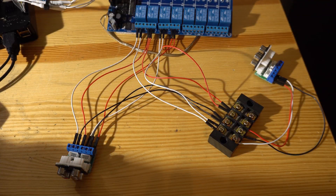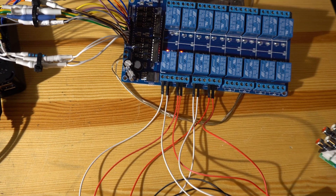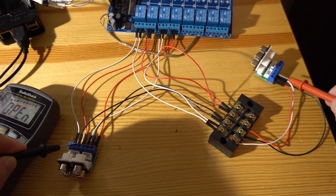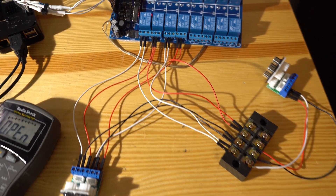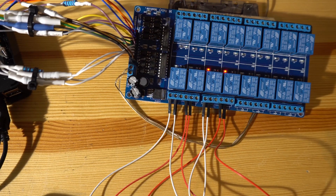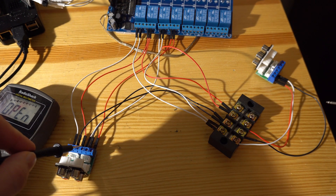To connect all the input and output components, we need to connect some RCA jacks to work with these relays. When I switch in a tape deck, it gets connected to the output jacks — it's that simple. I'll test it with this continuity tester, activate the last relay, and verify it goes through the relay to the left channel. All the grounds are connected together; just the left and rights are switched, which is also true with standard audio components. If I activate a second group of relays, the connection goes to the other input, basically simulating unplugging and plugging in components.